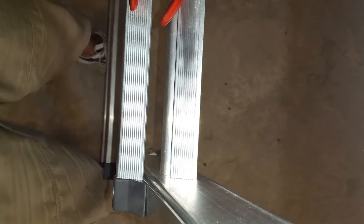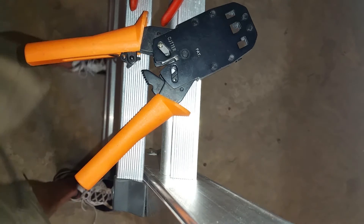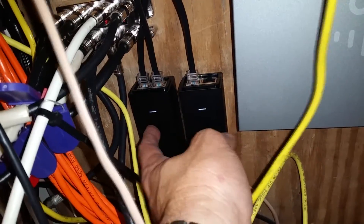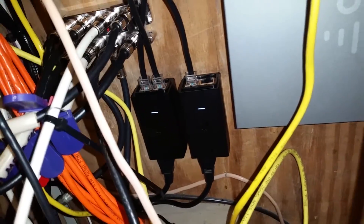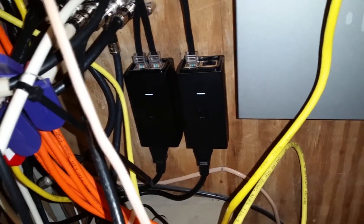I'm making a custom two-and-a-half-foot jumper that goes from the PoE injector LAN port into the network switch. I already made a custom one for the first injector, and I've now added the second PoE injector right next to it — one is for the basement, one is for the attic. I prefer independent injectors rather than one shared power supply: if one goes down you only lose one AP instead of everything. These are 24-volt PoE injectors that come with the Ubiquiti three-pack kit.